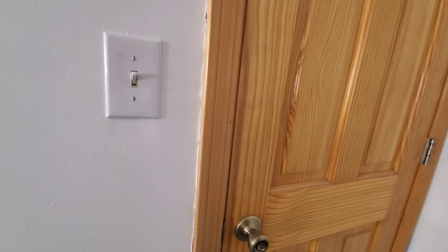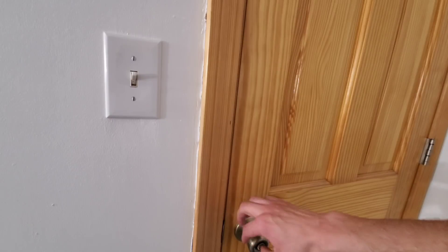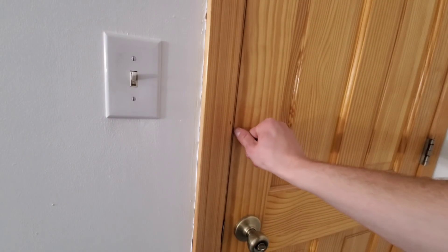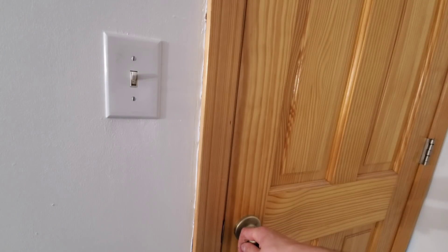While I'm at it, I'm going to fix this one too. The other one was only hitting at the top, but this one is hitting in the middle. The top and bottom have clearance, but the middle is touching, so I'm going to sink all three of them on this door.